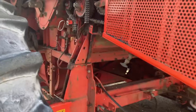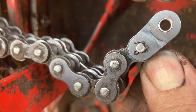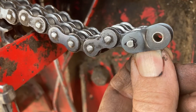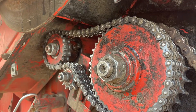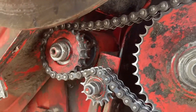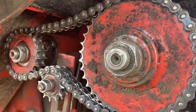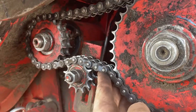Anyway, I'm going to try not to lose those things. I got them in there. I don't know if anybody watches ClickSpring — he's a machinist slash clockmaker on YouTube, and he's always working with tiny stuff like this. He probably doesn't even have any that big. I'm going to try and get this thing back together. We're back together. I probably could have put a whole link in there. That chain's pretty worn, but the sprockets are pretty worn too. If you're going to replace everything with a brand new chain on worn sprockets, you can have trouble — they like to get thrown off and stuff — so that's why I'm just replacing the half link.